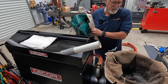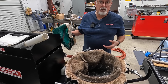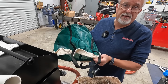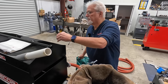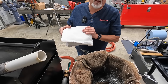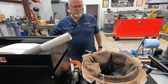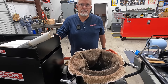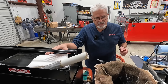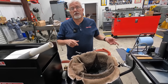The unit comes with three different filters. This is a coarse filter, and normally when you get the sump cleaner it's probably good to start with this, especially if it's a sump you haven't cleaned in months. There's a poly filter — our most durable filter — and with this we have customers who will run it over a year before they have to replace it. All these are replaceable. Then we also have a fine filter, sort of a cotton material. The burlap and the cotton seem to work better if you have a lot of tramp oil. The green poly attracts oil and might have more of an issue with filter blinding. If you have a lot of sludge, use the burlap, pump it back into the sump or into a drum, change to a finer filter, and then run it through again.